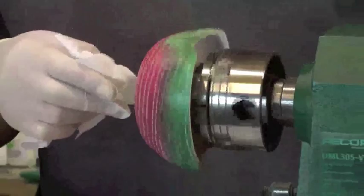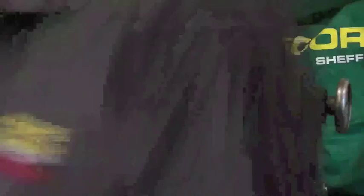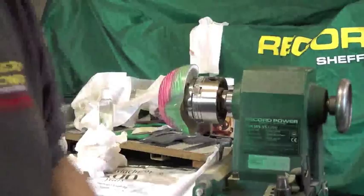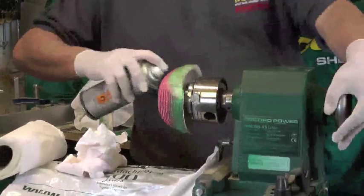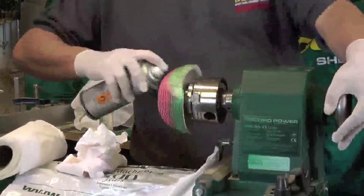What do we finish this with? We've got oil on here, we've got stain, we've got wax. But there is one product that's passive enough to enable you to put the finish on, and that's acrylic sealer. Don't apply it too wet — just dust it on. Two or three coats, just dust it like that, will build up your barrier. Then you can put whatever you like on as your top coat. Thank you.